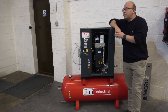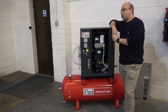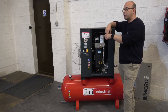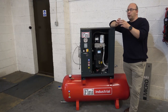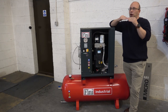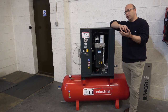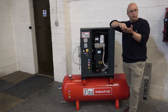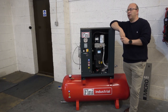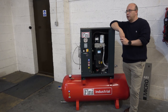Regarding the intake valve — on the smaller ones, you used to have to change the intake valve as a complete assembly; you couldn't service it. That has changed now. Primarily because we made a point to the factory about it. This unit has one of those intake valves because it's pressure switch controlled. The solenoid acts more as a blowdown valve, so the intake valve opens and closes based on suction pressure off the air end. They were a complete aluminium unit before, but now they produce a kit that gives you the shutter, the stem, and essentially a bolt and nut with an O-ring. The kit is about £105, whereas before the entire intake valve was about £354. Having to replace it every 4,000 hours as a complete unit was becoming ridiculous.